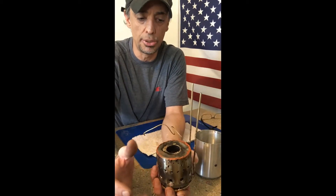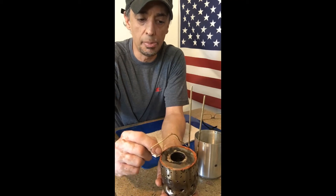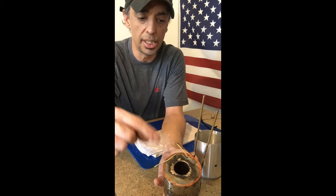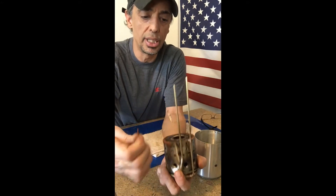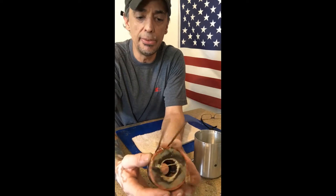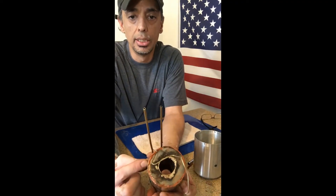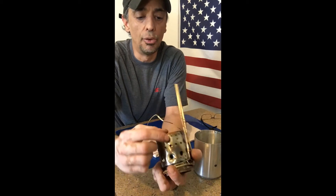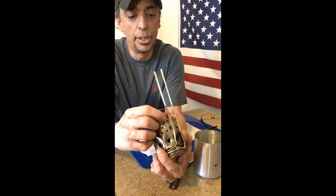Because I was testing a prototype model, I was curious as to how this gasket sealant would hold up for two reasons. One, it gets expensive — I can use a whole rod of silver solder after a while, and that becomes really expensive. Second, I wanted to see if I could come up with a different method that would be easier for you guys to put this stuff together, because not everyone can MIG or TIG weld thin stainless steel sheet without damaging it. Even the spot welder can create a hole if you're not careful. It looks like we have a winner here, except it's really not ideal — it will eventually want to break off, and oil makes it very easy for it to come off.